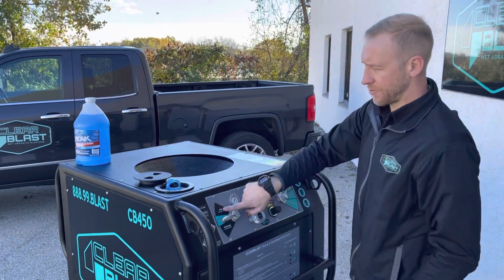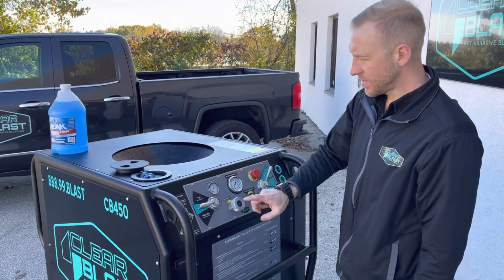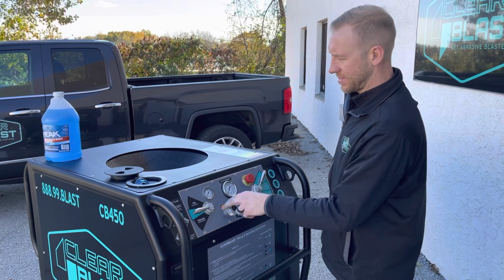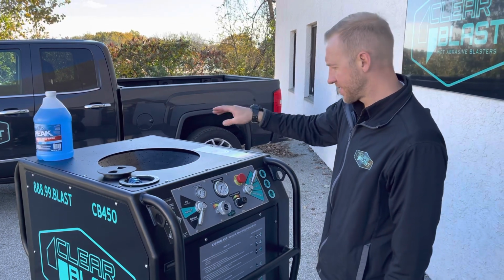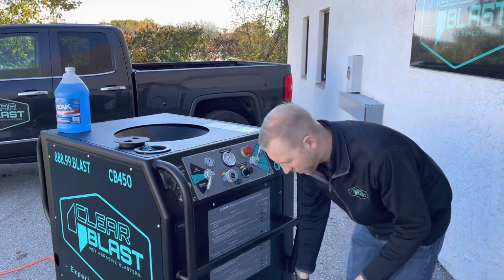And then next, you're going to go to pressurize for a few seconds. And then last, the abrasive dose, open, closed, and depressurize. That'll open the valve on there in case it held any water. Make sure that's also released. So now all the water in the system is out, so we can go ahead and hook up our water line again.